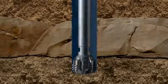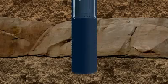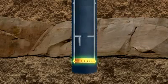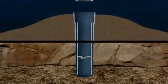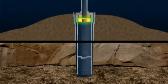A second run of conductor is now lowered into the hole. At the bottom of the conductor is a guide shoe that stops the conductor snagging on the well bore. Above the shoe is a flap valve called a float collar. A cementing tool is connected to the top of the conductor. A plug that pushes the seawater out is driven downwards by high-pressure cement that fills the conductor.